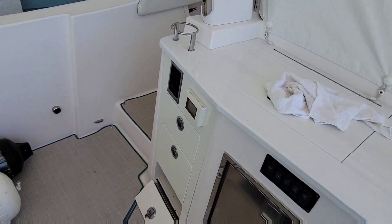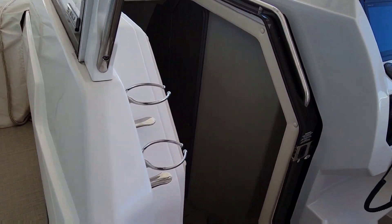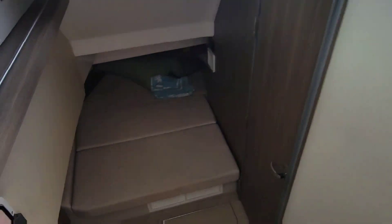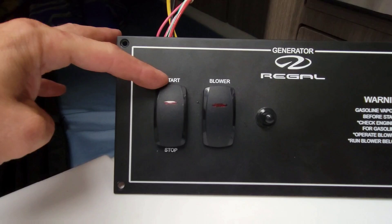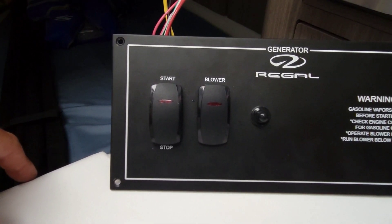Alright, so this is our next boat - it's a 33 SAV Regal, so I have videos on it already. I'm actually just throwing it in the mix of this one. Somebody already pulled this boat apart and tried to diagnose it, so I'm jumping in here to see if I can figure out what happened. The generator runs perfectly - you can start and stop it from the generator switch itself. But if you look here, something happened where if you push this button it'll start, but you can never turn it off from here. You have to open that hatch up and turn it off at the generator.